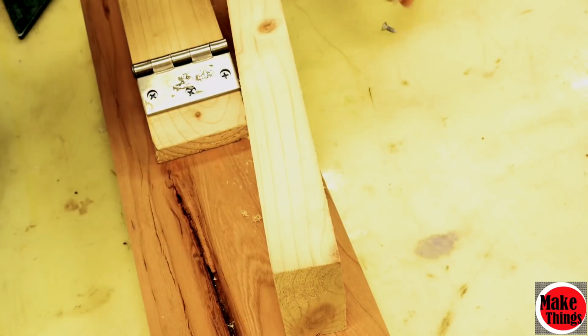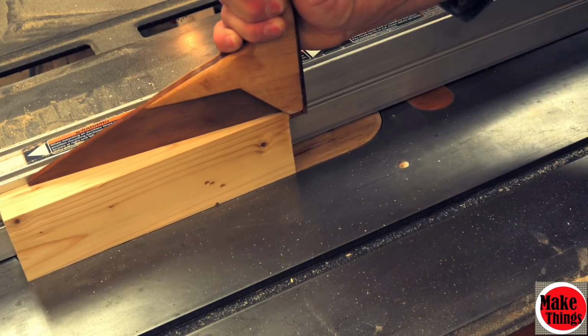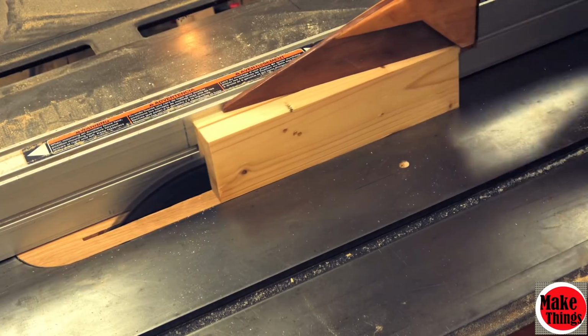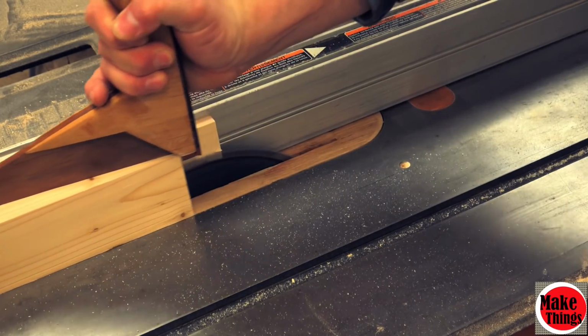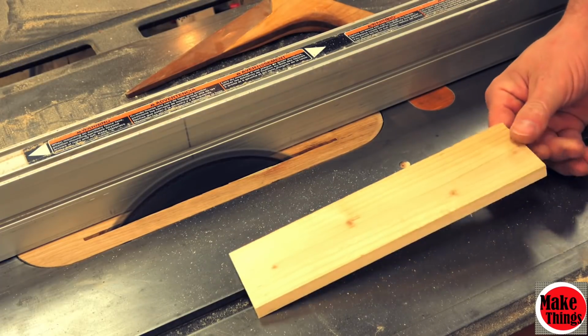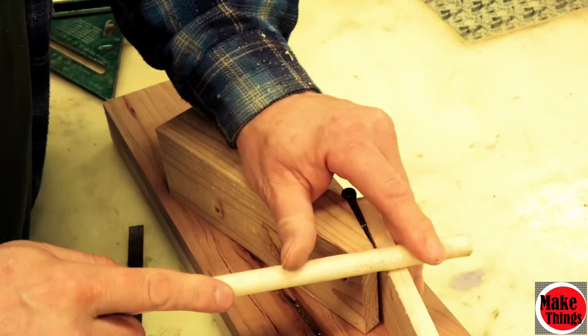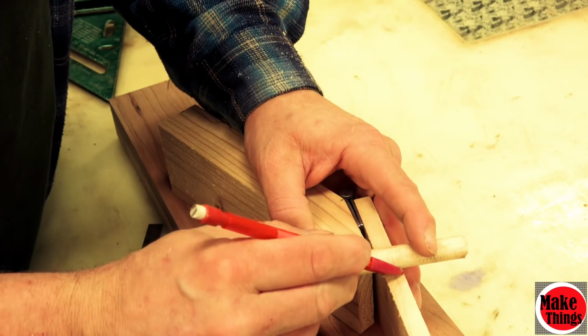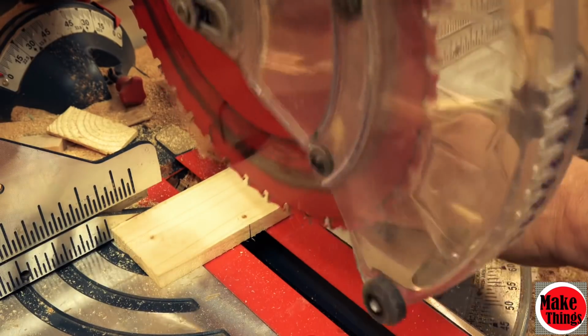Because my screws are a 1/2 inch long, I cut the thickness of the back flap to a 1/2 inch. That, with the hinge thickness, kept me safe from drilling completely through to attach the hinge. I made sure that I could fit a 1/2 inch dowel to the back before cutting the flap down to 2 3/4 inches.